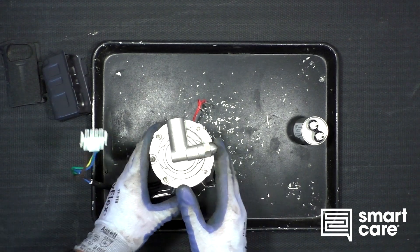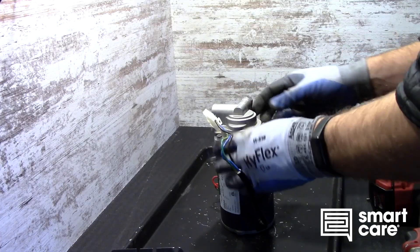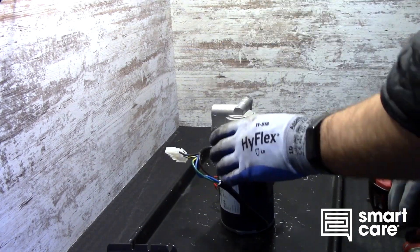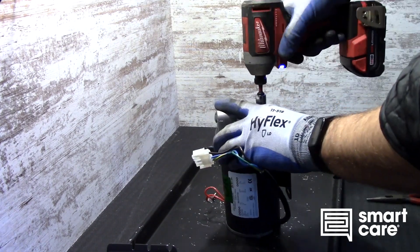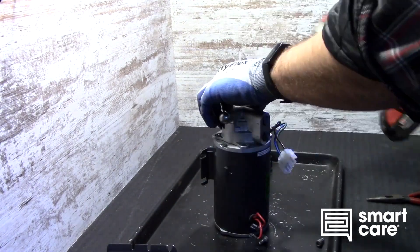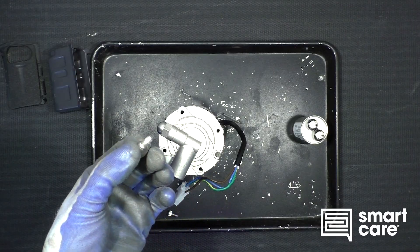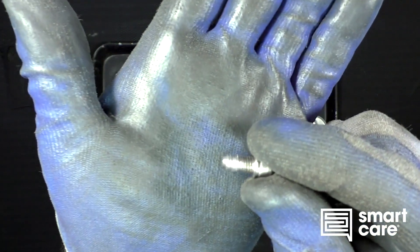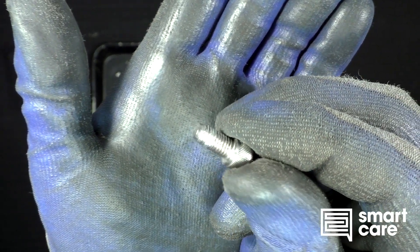Now as we look at this pump assembly, I'm guessing the pressure relief is under this acorn cap. What I'd like to do is pull these out and try to see if that pump assembly will come off and see why they don't want us taking it apart. I'm not sure if they had a really hard thread lock or if they were just cross-threaded, but those really did not want to come out. You can see the metal galled and got really stuck in the threads.